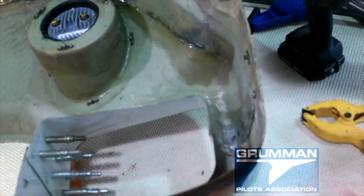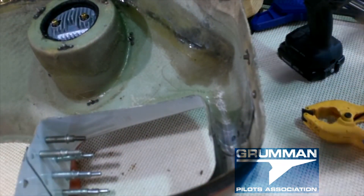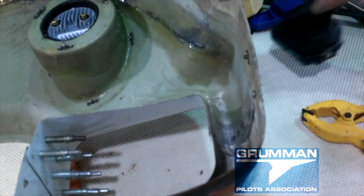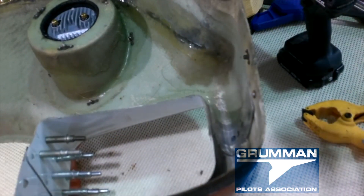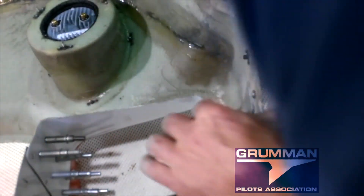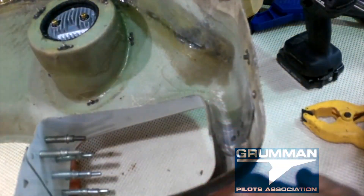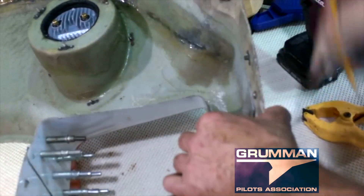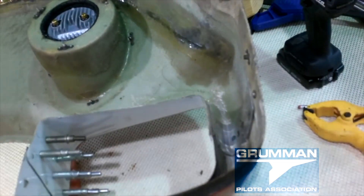Basically what we did was take the block of wood — it's not quite symmetric because the gorge in there isn't symmetric — and use that by taking the clamp and driving that aluminum all the way down into the gorge. That way it's really nice and well seated. Now there's a conundrum because we can't get the drill in here to drill these holes. So we're going to drill from the other side using a match driller — a hole finder, as some people call it. Neatness counts; we want these lines on the outside to match the cowling, and these will get adjusted as the metal lays in the airplane.